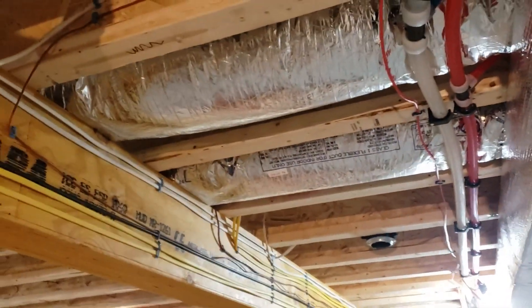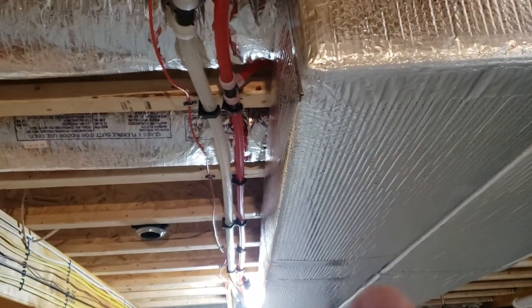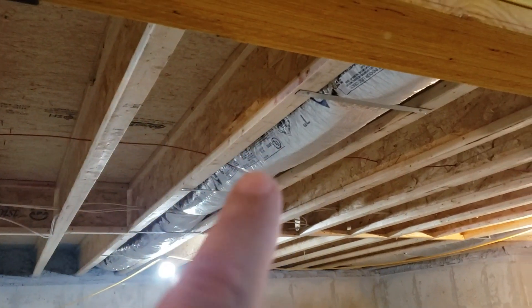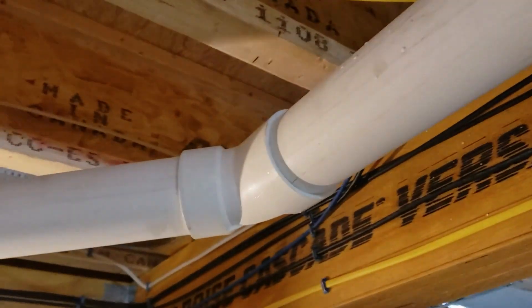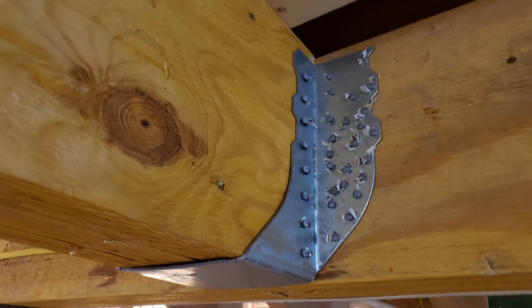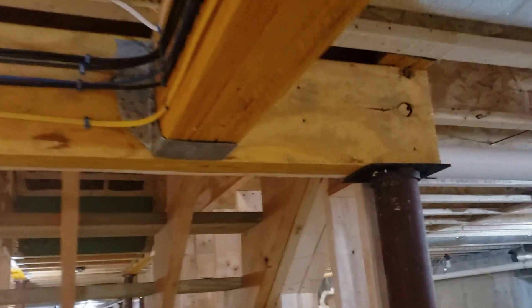The intention is that not only do the floor joists sit on top, but more importantly, the duct runs from the dirty basement where the big trunk is — they come off the top, run down, then run across and feed to different parts of the house. They're able to be maintained up there simply because we drop the beam here. As we follow this beam along into more of the dirty basement, that beam comes into what we call an LVL hanger — pretty sturdy, probably every bit of 40 nails in that hanger to hang that triple.